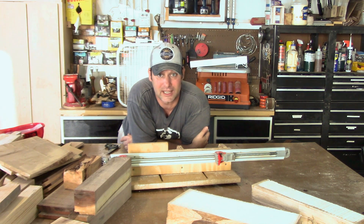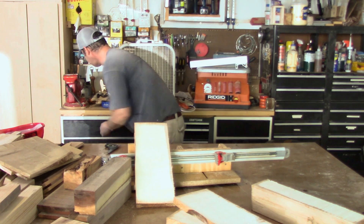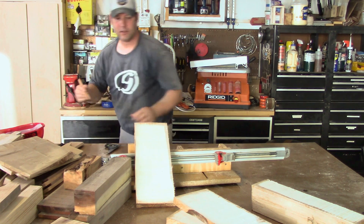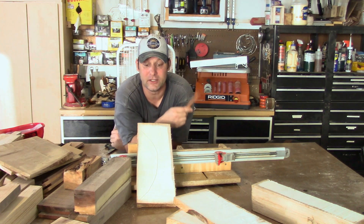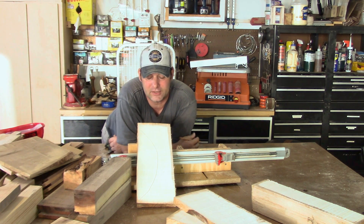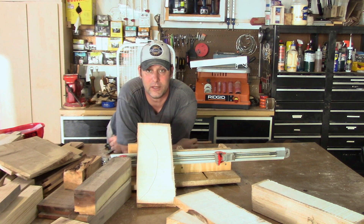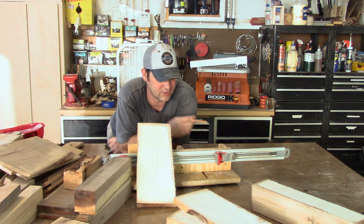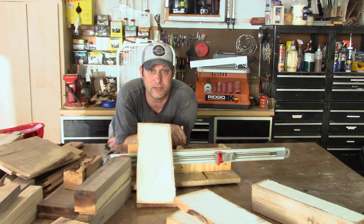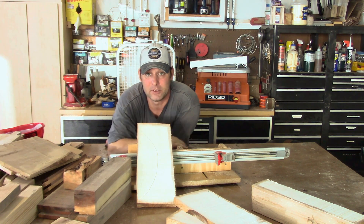That blade cuts great but it's a new blade so it's nice and sharp. The other thing you want to make sure is that when you have that blade on there, don't cut curves. If you use that blade to cut a curve and then go to cut straight lumber, it's going to swerve a little bit. The blade will try to work its way in or out — you want it to cut dead straight the whole way. Bandsaw blades drift; the sled helps straighten and correct blade drift. Having it tight, tuned up, and not having cut curves with that blade before all help stop the drift.